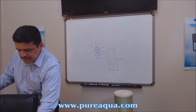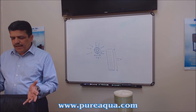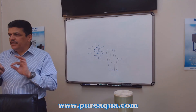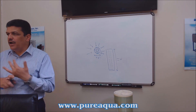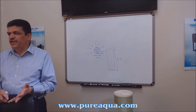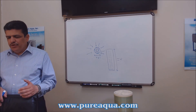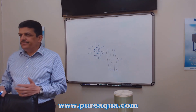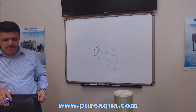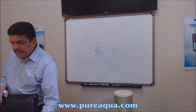That's the sediment filtration using spun polypropylene cartridges. Other sediment cartridge types available on the market include string-wound — available in cotton, polypropylene, or natural fibers, both industrial and commercial grades. But the most common nowadays, which really does an excellent job, is the spun polypropylene, which can be used for a wide variety of applications.